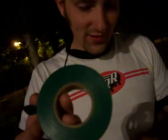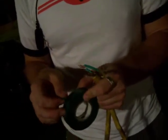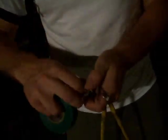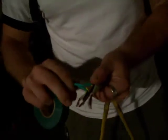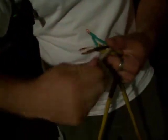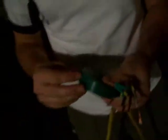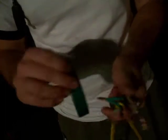Got some e-tape. Basically, all you gotta do is make sure it's unplugged first, and then expose the wires. Green is ground. White is neutral. Black is hot. And the simplest thing — just take it down to the bare wire just a little bit.